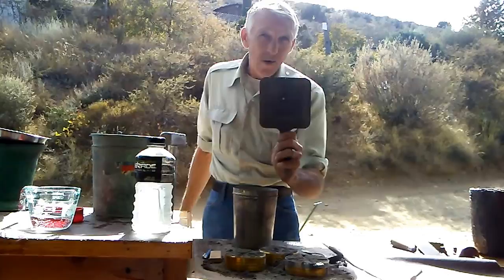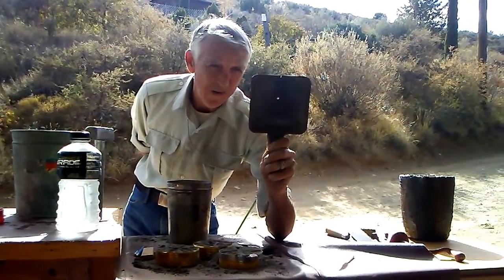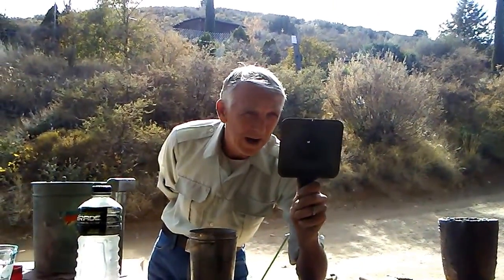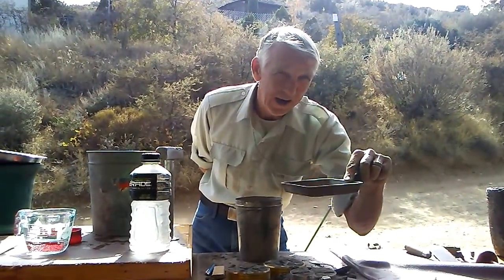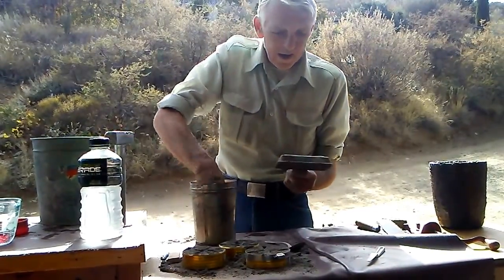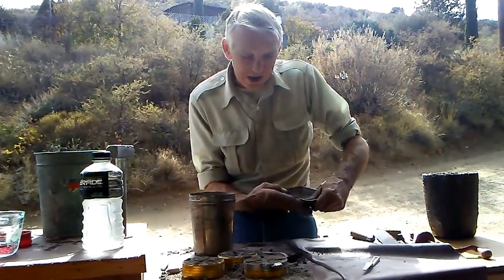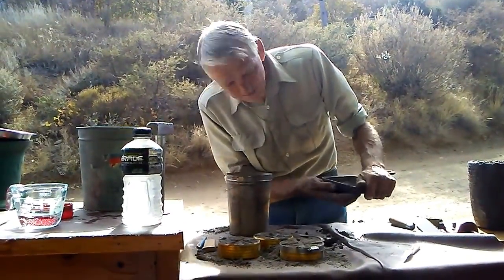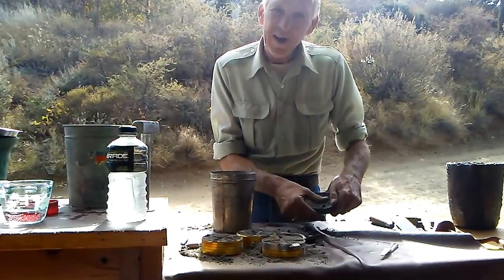Now, we'll take this old ingot mold that you've seen the failures on in previous videos of ours, and we have drilled a hole in it, and we stopped the crack. We filled the hole with the high temperature red RTV sealant, laid it in a bed of sand, and it still worked. What we're going to try today, we're going to squeeze and work some of this refractory into this crack as much as we can. Because we got ground glass in it, and that may just fuse it together. Well, anyway, it's an experiment.